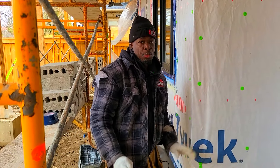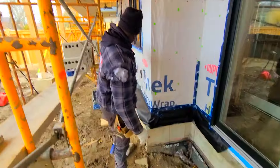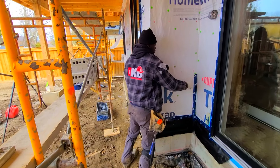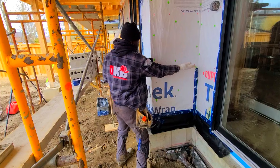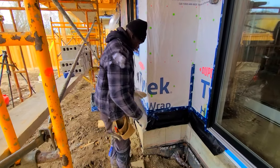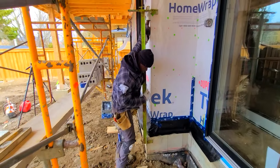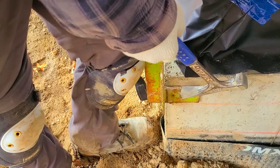Now that we've finished installing our weeping plastic, our next step is to install our corner post. We're gonna install one corner post here and another one down there. Usually if this wall was broader we'd put a strap in the corner to connect the wall to the corner post, but because the distance is so short you can use a level to plumb and level this section. So the first thing is to sit your corner post right onto the concrete ledge here.